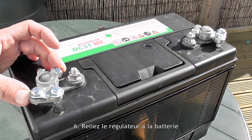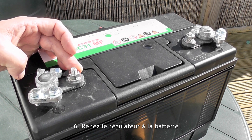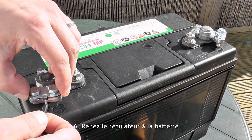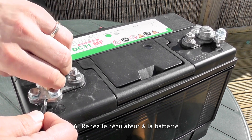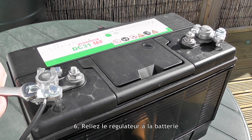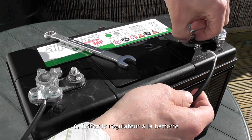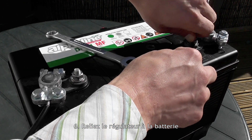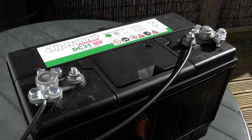There are two ways to do this: either you can use the connector that's attached to this lug here, or if you have these, you can wire it directly to these. I'm going to show you both. Take the plus wire and wire it in here. Then we have the negative wire, and I'll wire it into this terminal here — just curve the end around a bit and place it under here, then put the top down on it. Now you have your controller wired into your battery.